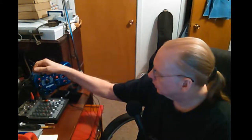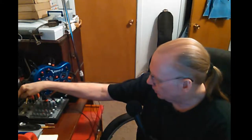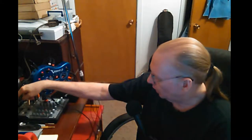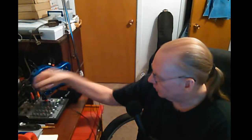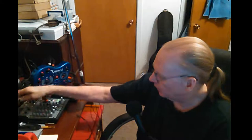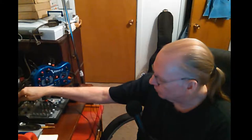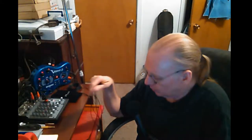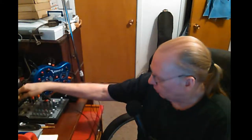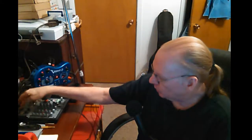The mixer will do that because, okay, my mic's a mono input, right? Single. It's TRS, but it's XLR. TRS is tip ring sleeve. So XLR, it's still the same type of connector, though the pinout, the wiring, is different in each one. But from a mic like this, an SM58, this is a balanced signal going in here. And so the mic signals are really expected to be balanced, whether they're XLR or TRS.